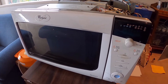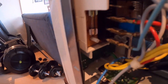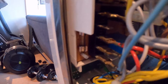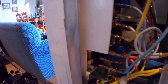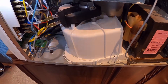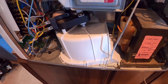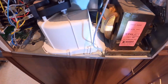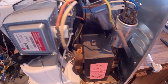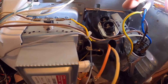This time, every few seconds or so it blows the fuse. The fuse on this microwave is a slow-blow 20 amp fuse sitting on the circuit board, and it blows every time you turn the microwave on. The fan was working fine — I cleaned that up. But connecting the primary up immediately blows the fuse, regardless of the magnetron or capacitor. I tried a new capacitor and new diode — still the same.